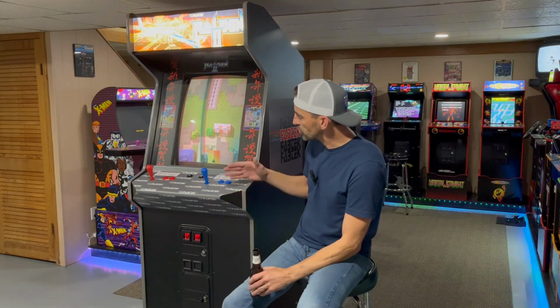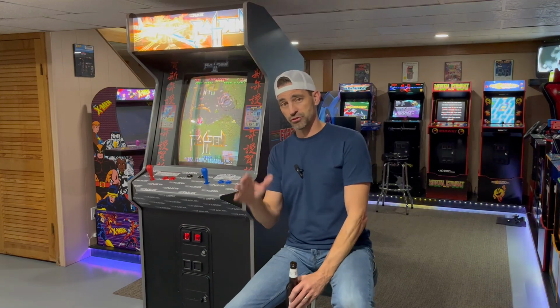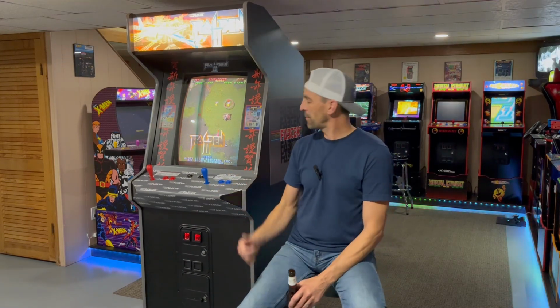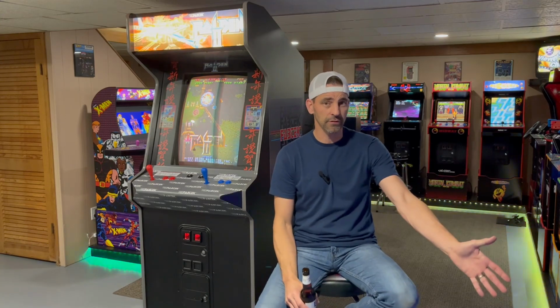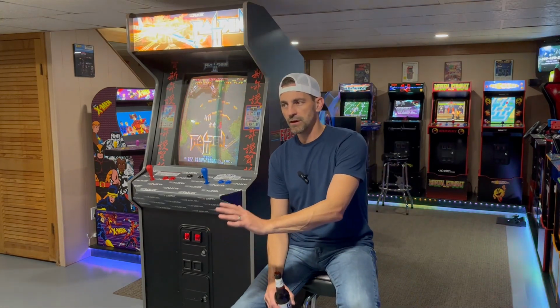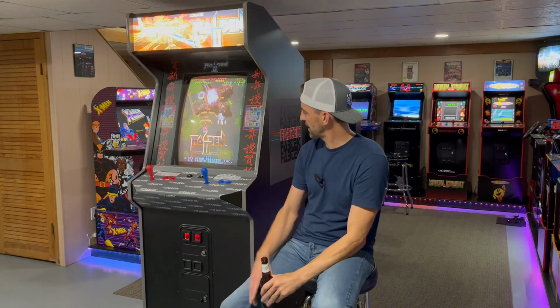At the end of the day, it really wasn't that difficult to get this thing up and running. If I had a good monitor to start with, the cost on this would be within reason. But because I didn't have a good monitor and had to outsource that, because I had that 7400 instead of a 7000, and 7000 is much more common. I had a 7400 chassis, and to get a new chassis or just the flyback, I got the cap kit, but I couldn't find a flyback, and that was the big problem. So I had to go get another monitor.